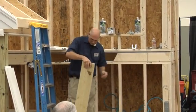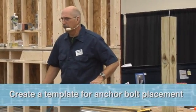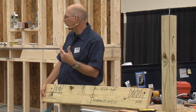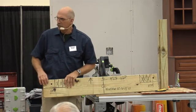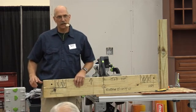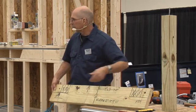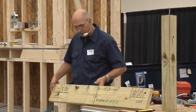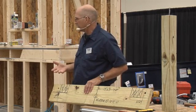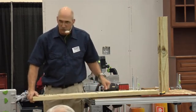If you're still using anchor bolts, here's a little trick: I'll take and make a template. I'll use some scrap wood and lay out my windows while going over my plans. In this case, say this is an 8-inch concrete wall we're going to pour for a foundation. I'll make templates up out of 2x or three-quarter inch plywood. What I've done here is a window layout — a number of windows fit this layout. I'll take centerlines from the outside of the foundation and figure out the centerlines of all my window and door openings, then drop this in and center it exactly where that window needs to go.